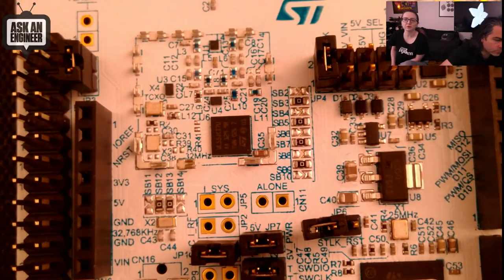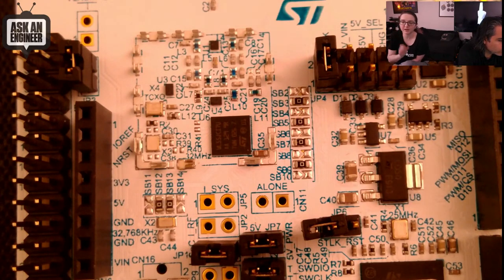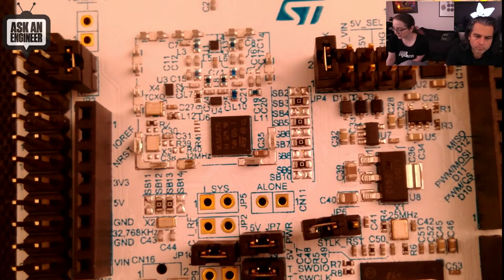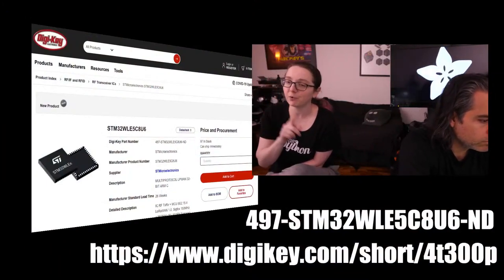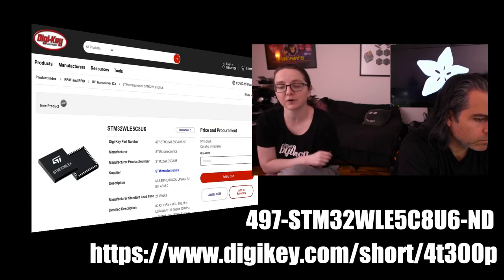It runs — I think you can do like 100 to about 1,000 MHz. It's sub-gigahertz. You don't have to use LoRa — you can also use FSK or BFSK or other encodings, although I picked this because I really like LoRa and the idea of an all-in-one chip is great. You'll have to tune this antenna section for the antenna frequency you want. People ask me all the time, like, can I tune this between 100 and 900? Well, that's assuming your antenna is good between that range and your front end area is tuned to that range — if not, you're just going to have to pick a narrow band of about 100 MHz and stick to that. So that's the STM32WLE5 series. One thing to watch out for — there's also the 4 and other chips. The 5 is the one that has the LoRaWAN stack, so that's what I recommend if you want to do all-in-one LoRa microcontroller stuff.